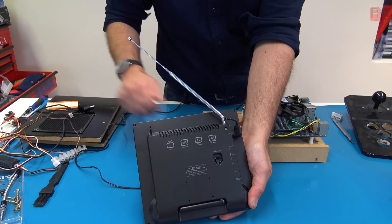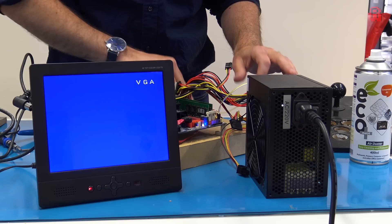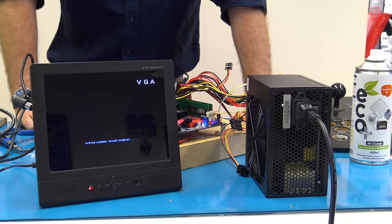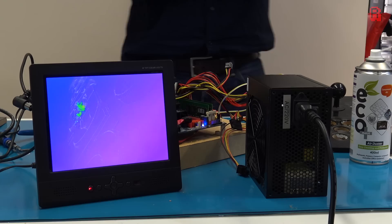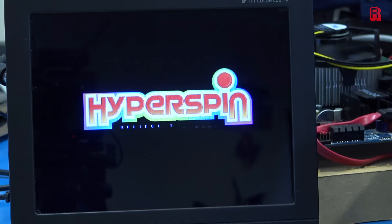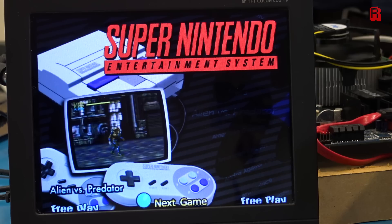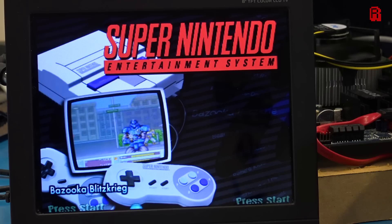The perfect camping or caravan holiday companion — or indeed mini arcade machine monitor. I'll test it here with an ATX power supply; the external brick I need hasn't arrived just yet, but it will be before the end of the video. Seeing this come to life was a truly beautiful moment. What you're seeing is Windows XP booting with a custom loading image. What you won't see is a mouse cursor, Explorer, a desktop background or anything that might break the immersion that you're using an arcade machine. Games for me are about escapism, and even the quickest flash of a mouse cursor can bump you back to reality. It launches the HyperSpin front end with game preview videos and artwork depending on what system and game you have selected. I really like this front end, but sadly development stopped some years ago — so even our front end is retro here. We can navigate all systems and games using just the arcade control panel; no keyboard is required.